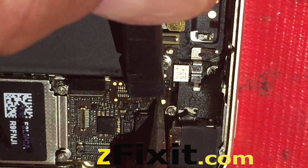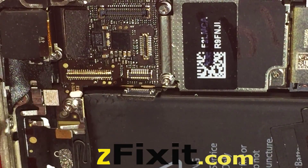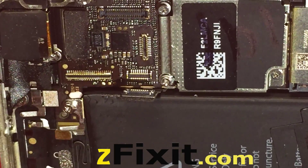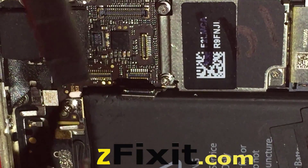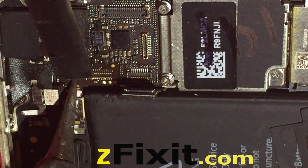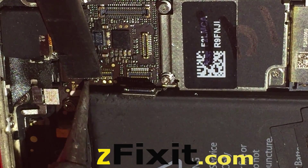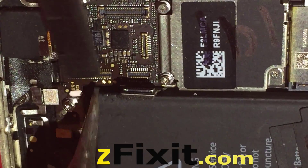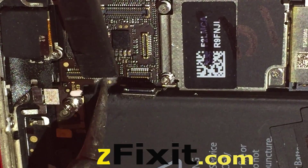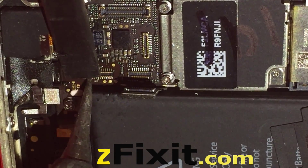Later on I do place a little bit of solder onto the tip and it flows onto the point. Flux is important — make sure you always use flux. It allows any existing solder on the solder pads to properly adhere to the new FPC. I also place additional solder wire onto the iron. The flux prevents oxidation and allows it to have a good solid joint, so always use flux.